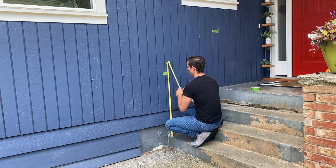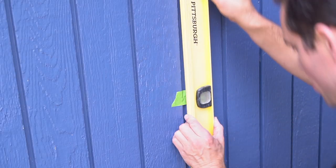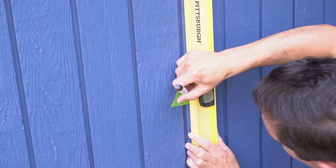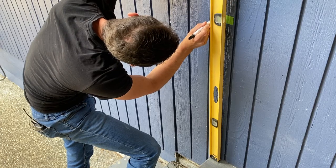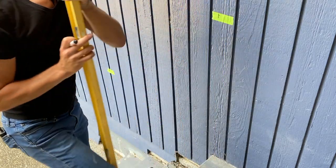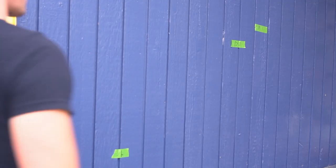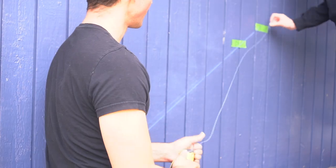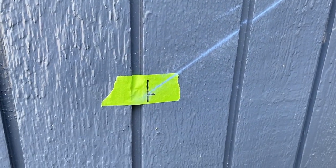The easiest way to account for the proper height and angle is to take your tape measure and at the very front lip of both the bottom step and the top step, measure 36 inches. I then take my six-foot level to make sure it's properly straight from the very front of the step lip. For connecting those two heights together, I always suggest using a chalk line — it's very easy to get a perfectly straight line and it's easily removable.